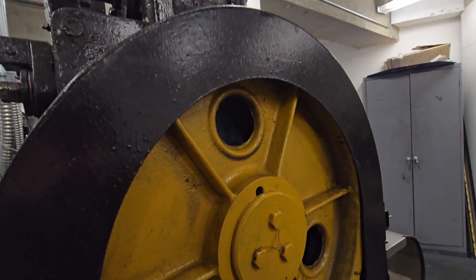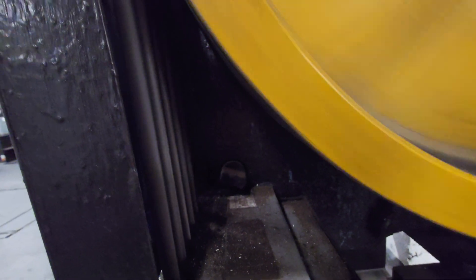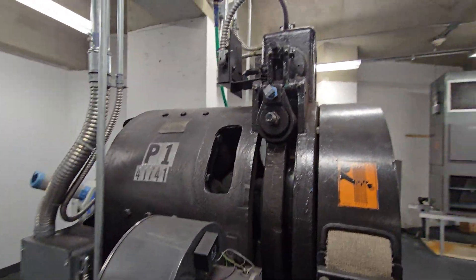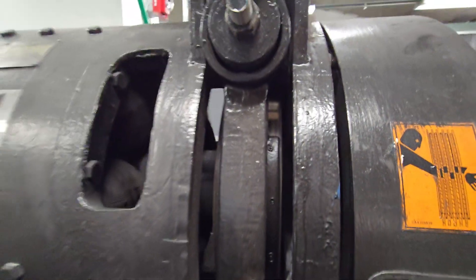Here's the sheave for it. In here there are grooves that grip around the cable, and those are the cables themselves — you can see it's now moving. There's a cooling fan for it, there's the solenoid for the brake, there's the brake pads, and you see in there that shiny thing — that is the brake drum.